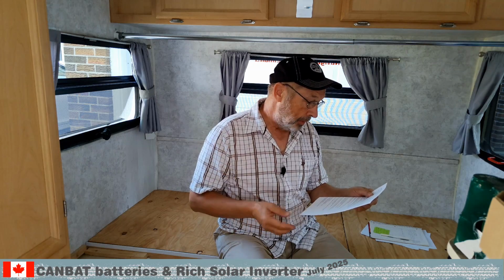Now part 2 of the video, we have actual numbers. What we learned from the solar generators we tested a while ago: when the inverter is on, it draws power. Even though there is no load on it, the battery can actually deplete in 1 or 2 days. It is called the inverter idle power consumption, and it is not something that's freely advertised on the website.